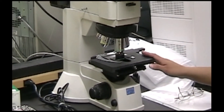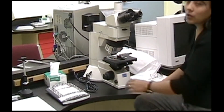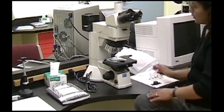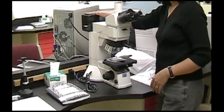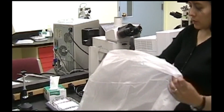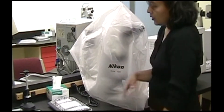When you are finished, switch back to the 5x objective lens in reverse order, then lower the stage. Take off the sample and turn off the machine. The lamp house can get too hot, so you will need to wait for it to cool down before you cover the machine. But don't forget to cover the machine and sign out.